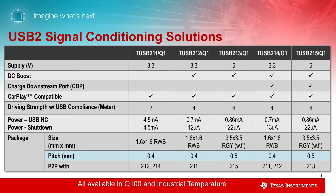It further enhances USB 2.0 signal quality while compensating channel loss, eliminating components such as an LDO or BC1.2 charging controller. It also reduces system board cost, enabling efficient board design with improved system performance.